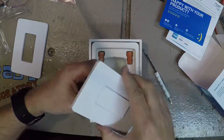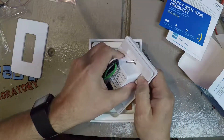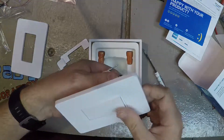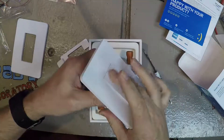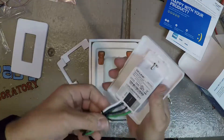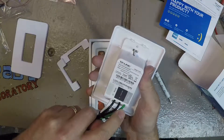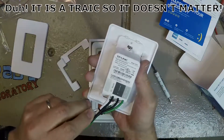It's kind of a pretty giant light switch plate, but I imagine that can just be popped off and it's just a standard Decora — it's a push on, push off kind of thing. And there's that neutral wire that I'm going to need. Live, load, and ground — so hot comes in. Kind of interesting, it's not marked. We'll get it figured out.